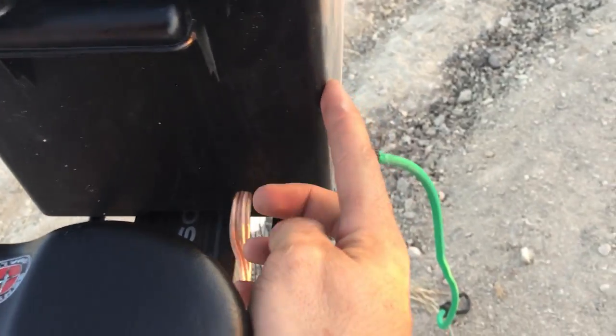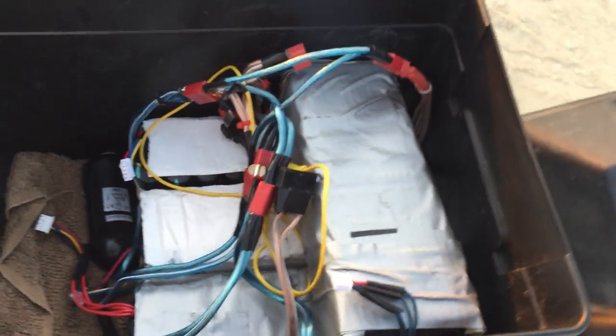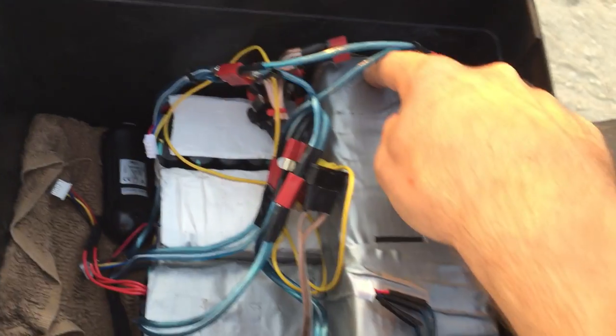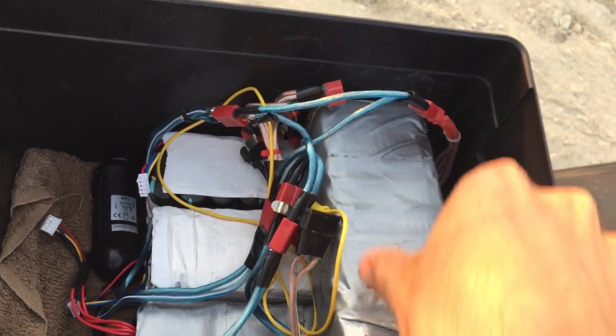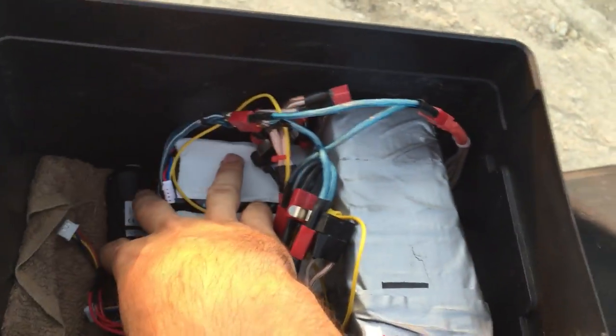As far as wiring, the batteries are wired up in series. We've got four of these packs. Each pack contains 18650s wired in 10P by 3S, so there's 10 18650s per cell group. Those are all wired up in series — four packs total — to equal 12S lithium-ion. So I have 120 18650s in this box.